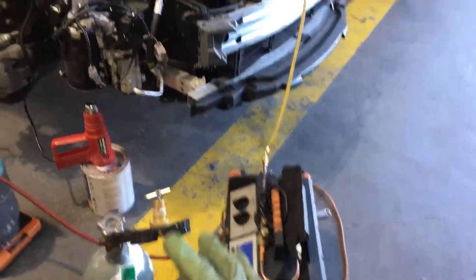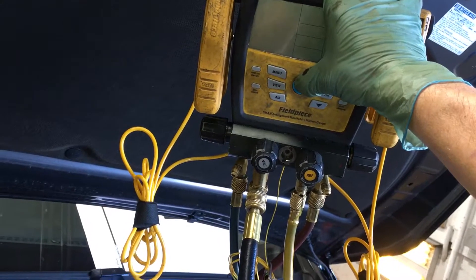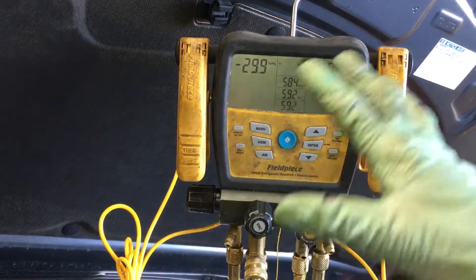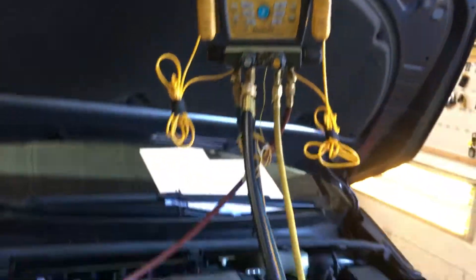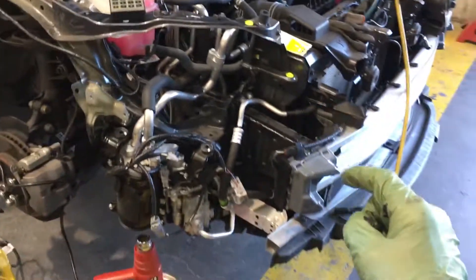Charge for it. Right now, I'm finished. I had to redo this three times to finally get the refrigerant out of here. Let's see what I'm pulled down to right now — I know I'm down into the microns, all the way down into the 700 micron range for the fourth time. And every time I reheated it up, it always brought it up positive 10, 20, 30 PSI because of the amount of refrigerant that was trapped inside the system.